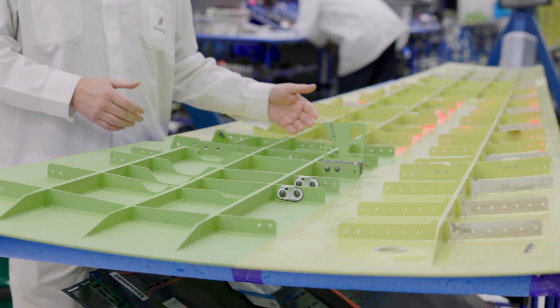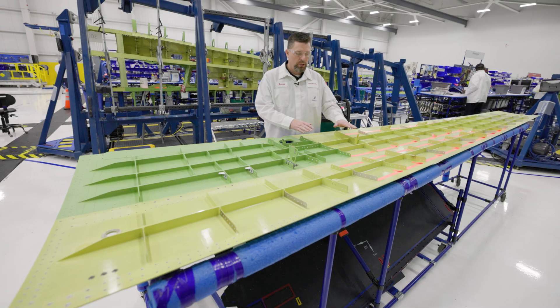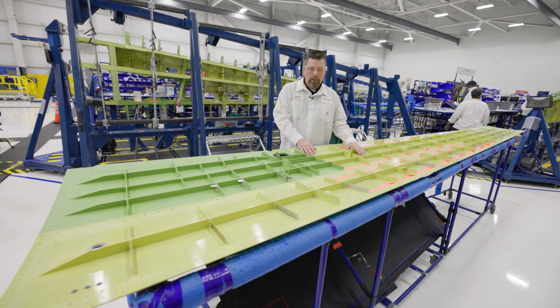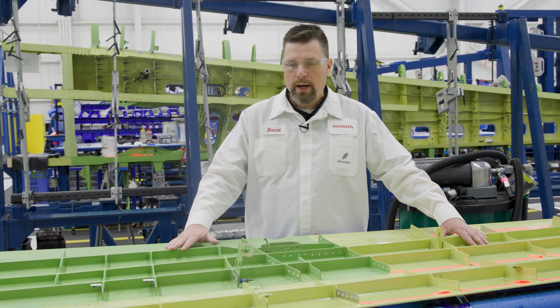I just want to point out the difference in the colors. A lot of people don't know that in the wing of your aircraft, it's actually serving as one of your fuel bays. This yellow-looking color is a fuel-compatible type of paint that we put on the wing, while the dry bay area just uses standard paint — that's not required there.